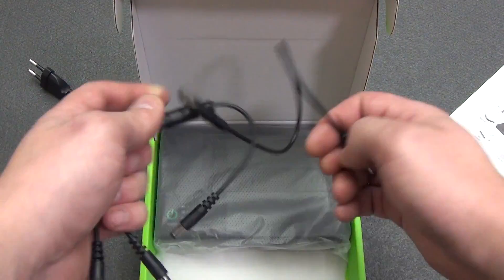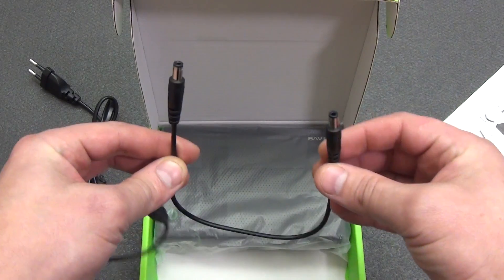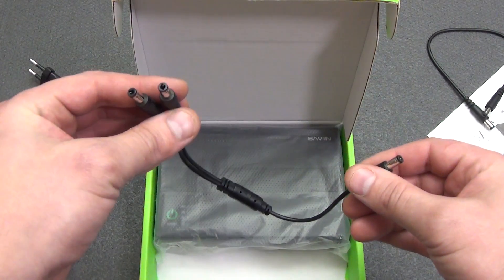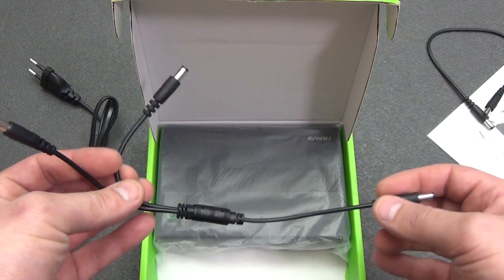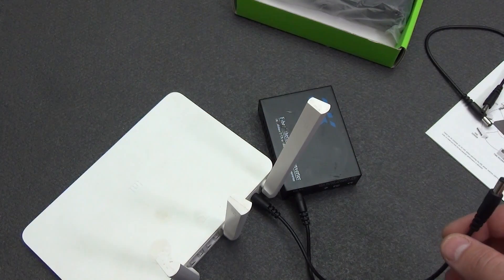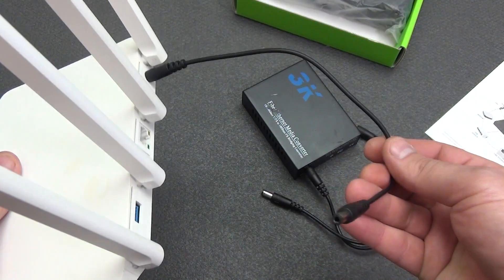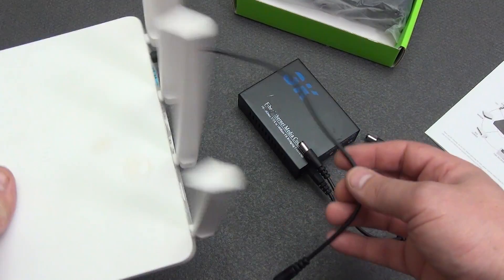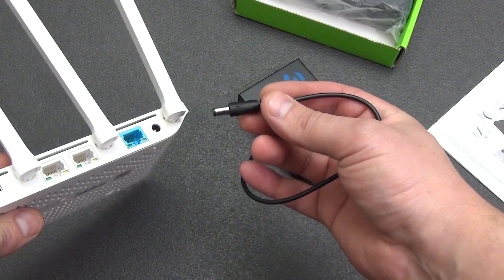There are also two cables for connecting devices to the UPS. One cable is female-female, plug 5.5×2.5mm, 30 cm long. Another cable is also female with a 5.5×2.5mm plug, 30 cm long, but it has a double output — very convenient for connecting devices that require the same input voltage, for example a router with a 12V power supply and a GPON terminal which also has a 12V input. Or if your router has a 9V power supply, connect it to one cable and the GPON terminal to the second. In most cases, the Wi-Fi router and GPON terminal have a power port for a 5.5×2.5mm plug.